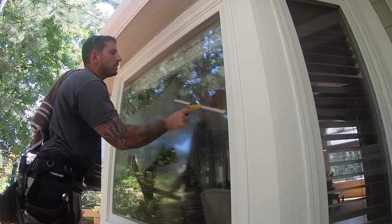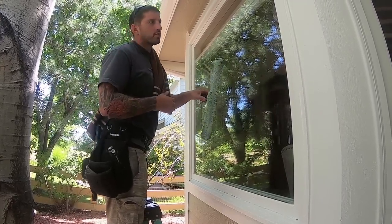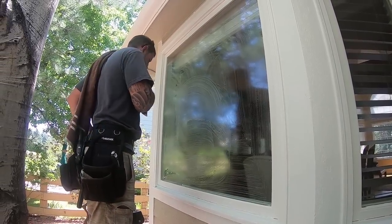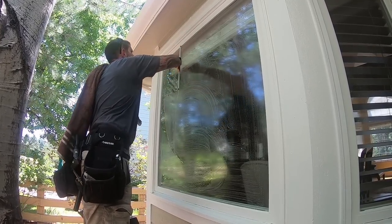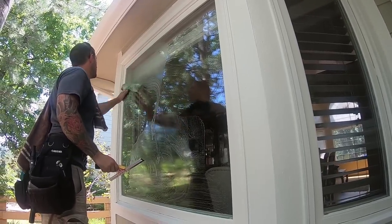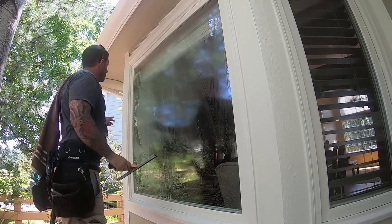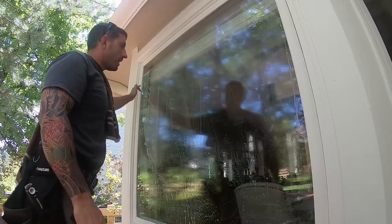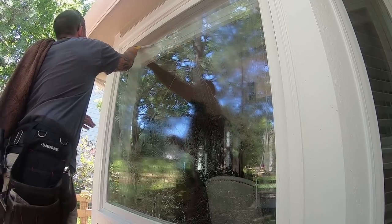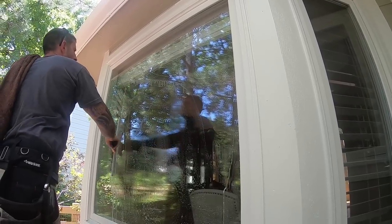The 18-inch is probably going to be your most efficient squeegee to use. Some of the most common mistakes when fanning start with the entrance to the window. Most guys, after they've mopped up the whole window, will cut into the glass, come to the other side, and just try to hit the motion down right from there. What you're forgetting is that when you enter the window and take your squeegee away, you're leaving a small triangle area. Just like when you do a straight pull. You need to come back and grab that area after you've cut in, then work your way down the window.